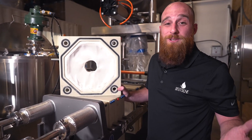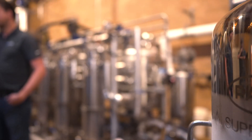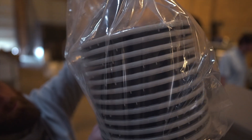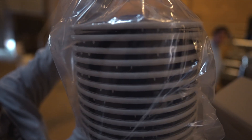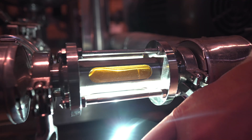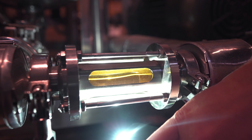Now you can stop here, but there's no fun in that. So from here, we'll be able to transfer this crude oil extract that's been secondary filtered into our lenticular filter. From the plate filter press, the liquid is going to be pushed into the filter housing through the inlet pipe. This is achieved by applying positive pressure to the feeding vessel using either a pump or compressed air. As the liquid flows into the housing, it surrounds the filter and envelops each cell. The pressure forces the liquid into the filter media of those cells. As the fluid moves through the depth media, it follows what's known as a tortuous path, meaning that it takes a non-linear route. The numerous twists and turns that the fluid must take deplete the energy of those particles in the fluid, causing them to become trapped within that filter media and producing that clear, gold, transparent liquid on the back end.